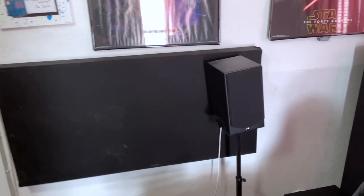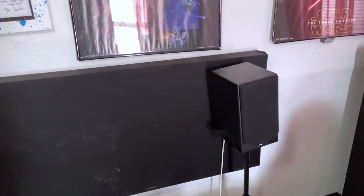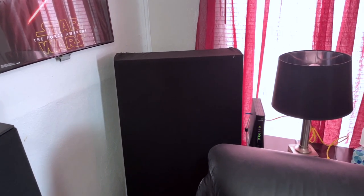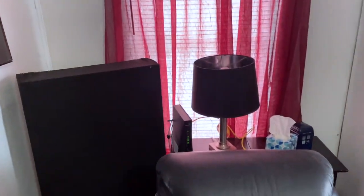The final furniture pieces are the speaker stands for the rear surrounds and my acoustic treatments. The same buddy and I built these two-by-four-foot absorption panels. We went narrower in one spot so he made a one-by-four panel, and there are two panels in the back. They're basically one-by-two frames filled with rockwool. Back there is also a two-by-four-foot, four-inch-deep bass trap in the only corner where I could fit one. Down there is my secondary SVS SB12-NSD sub, also purchased on the factory outlet sale for $400.